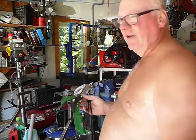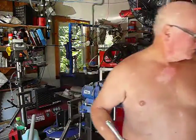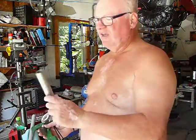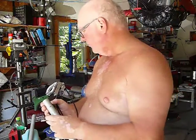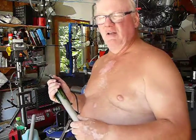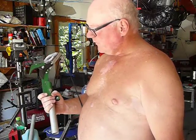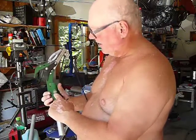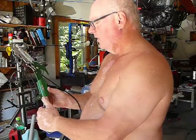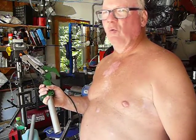I can't add any more than that because if I did, the inside shaft wouldn't retract all the way. So here's the one-inch conduit — this EMT I'm going to use. I'm going to cut this down a little bit, but I have it marked. I'm going to drill a hole through the center. Now, if I use this pipe, which is slightly larger than the original, the center hole that this was held in with — which was just a pin that was bent over, not even a screw or a bolt — that won't be in the center. So I'm going to drill another hole so that it will be in the center; I might drill two, one up and one down. And then I'm going to weld this to this pipe, because there's really no good reason why it shouldn't be welded.